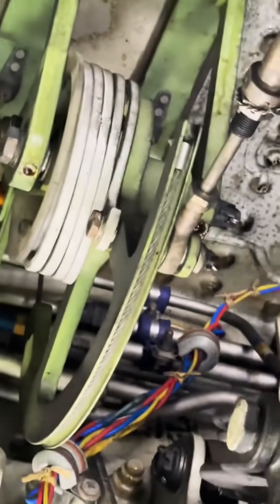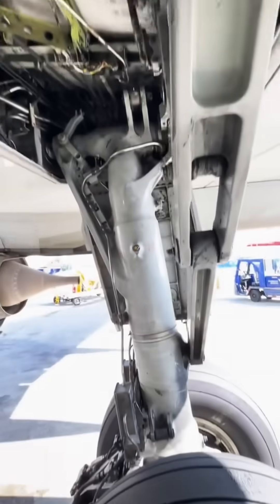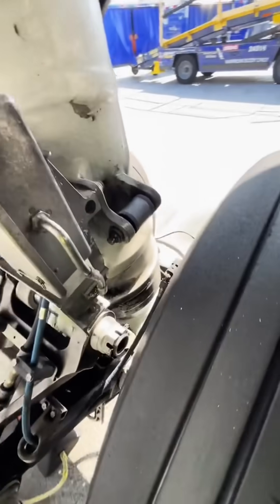This pulls the control rod and turns the lever. When the lever is turned, the uplock actuator gets released. Look closer — you'll actually see a spring there. The cable gets retracted as well, and right next to it is the uplock actuator — the one with the springs. Take a look at the strut; you'll see a little knuckle. That gets locked into that uplock actuator. That's it.